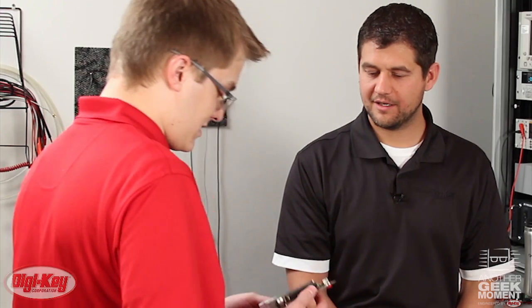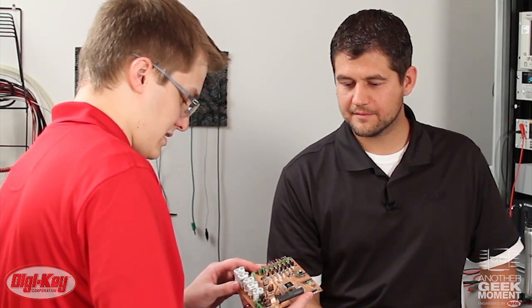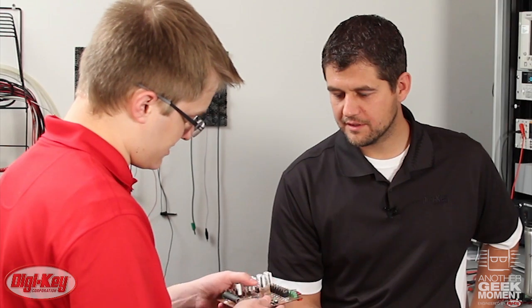Hey Brady, what's going on? We're shooting a video here. Sorry about that Chris. I got this project due this afternoon and I can't seem to get it working — I just burnt my finger troubleshooting it. What'd you burn your finger on? Well, it's this darn linear regulator I got on here. It keeps heating up and I can't troubleshoot anything fast enough before it shuts off again. It's probably got thermal protection built in — that's why it keeps turning on and off.